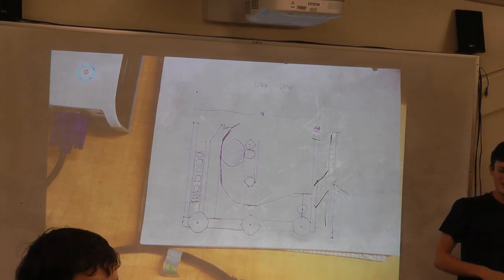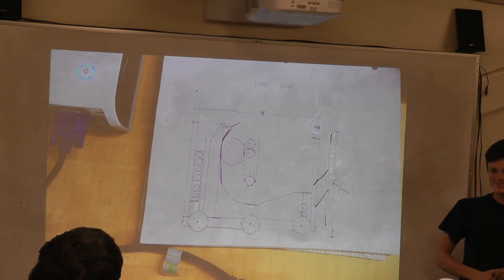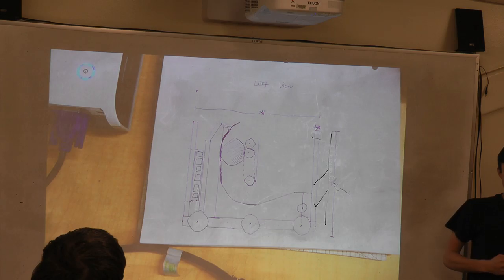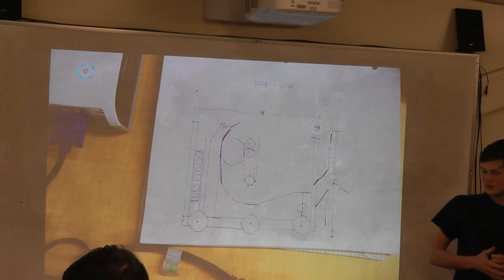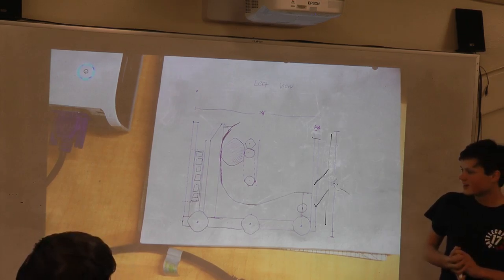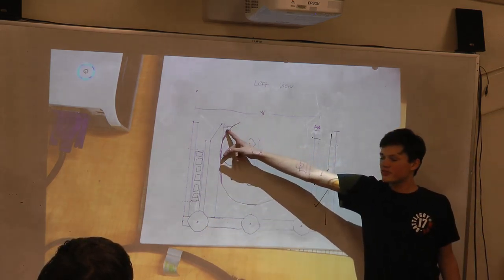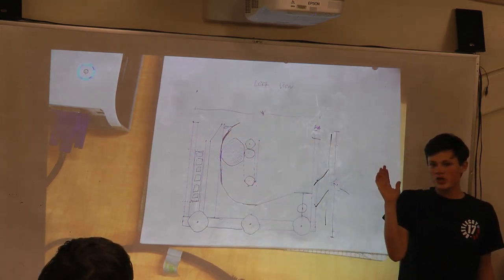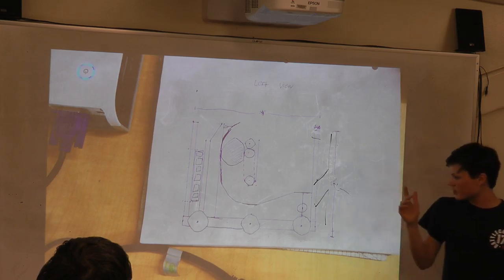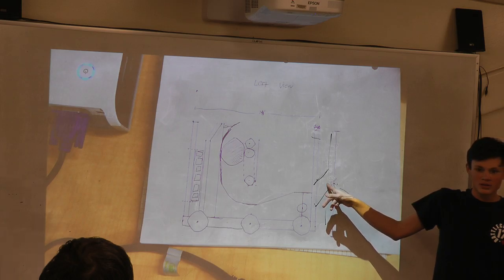You said you're going to use pneumatics a lot. Yes. How much current do you think a compressor would run? First, are you running a compressor on this robot? And if so, how much current would it draw, and how would that interfere with your shooter toward the later end of the match? So the pneumatics we are running are 2 very small cylinders. One for the hood, which actually needs to be kind of beefy so that the hood doesn't deflect when we're shooting balls. And 2 for this linkage if we end up using it. And the shifters.